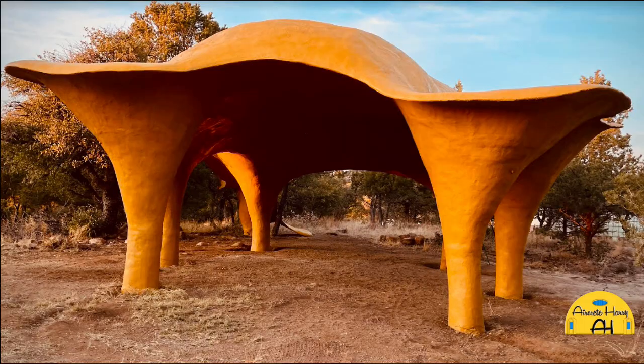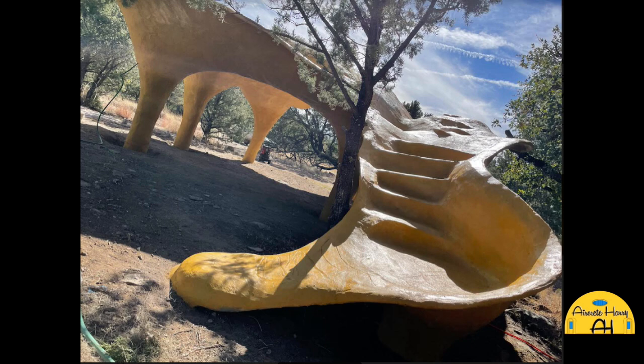So yeah, I start off with some of it embedded into the lath. You put it on in little globs, and some of it gets embedded into the lath. And then you put a layer that's about a 1/4 inch to a 1/2 inch above the lath, and you gauge that with your trowel as you go. And then the second layer on top of that is about another 1/2 inch. So it's about 3/4 of an inch.